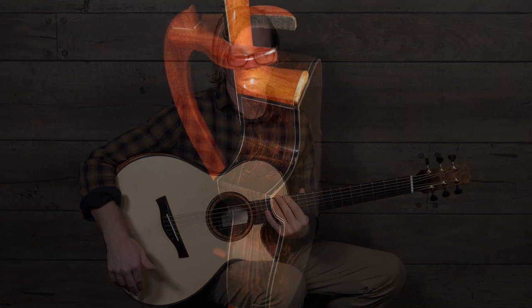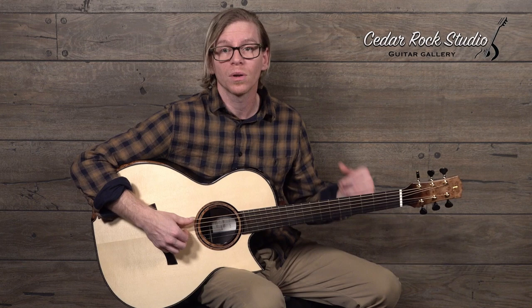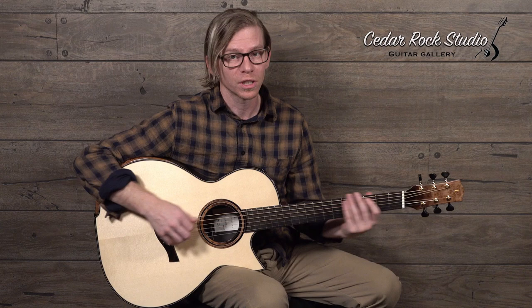But one thing I do want to note is he creates an asymmetrical heel here, and carves harder up in here for the cutaway so that when you really transition up to here, it's so easy to play all the way to the end of the fretboard. Now, as you can see, it is kind of odd looking. It's fan fret, but it's 25 scale length on the trebles and 25.6 on the bass. So it's just over a half inch fan, but good Lord, is it plenty to make the bass gigantic